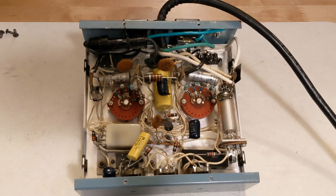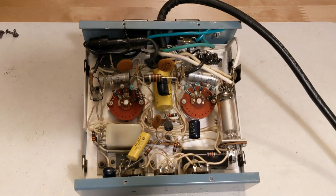The circuit is quite simple and uses an SCR, or silicon controlled rectifier, which is triggered by a neon lamp to control a relay. The neon lamp is connected to an RC circuit where the resistance is controlled by the time switches. When the RC circuit charges up to the lamp firing voltage, it triggers the SCR which energizes the relay. The range switch uses 1% tolerance precision resistors in order to meet the specs for timing accuracy. To maintain consistent timing as the line voltage varies, a voltage regulator using a 0A2 gas regulator tube generates a constant 150 volts DC.